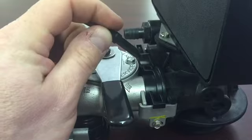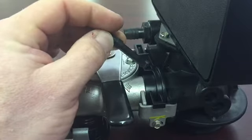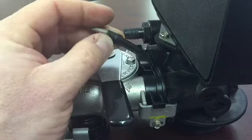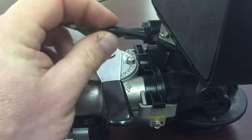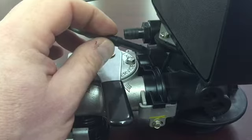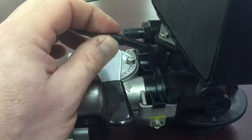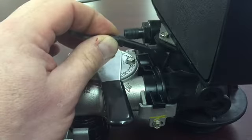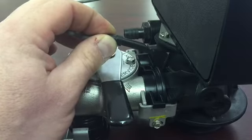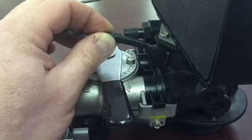If for some reason your water softener is not regenerating, not using salt, or not counting gallons, this is a simple tutorial showing you how to check that. The first thing you would want to do is look at the display on your water softener with a fixture running on cold to see that your gallons are decreasing. Whatever your gallons start at, let's say it's 1,000 gallons, it should count down after a few minutes of running water, maybe 5 minutes. Check and make sure it's dropped down to 999.